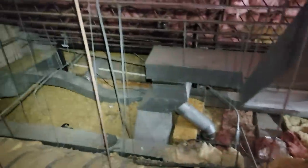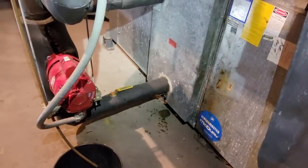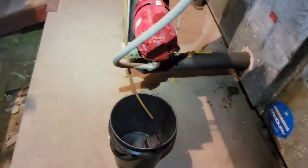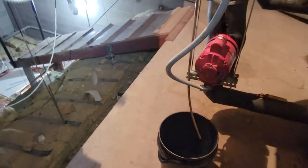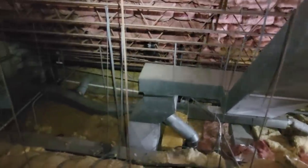Well, it's been at least 15-20 minutes, but I just heard some gurgling of water down there — it's got to come across, then come up, then fall down. I doubt we got everything out of this coil because it's below grade. But we're pumping the remaining in there — we got the 55 gallons in and we're starting to add some more. We should have a full coil of water here. The chiller was completely empty, which, like I said, it's just a plate heat exchanger so it's not very big. We've got a few other areas of the church that are probably still full of water too. The thought and theory was the water level comes down and then it goes back up with glycol.